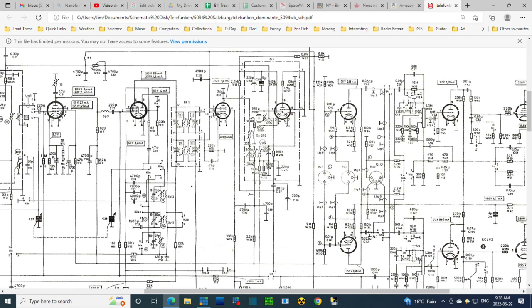One channel appears weak and the other one does not. And I know that because I fed the signal right at the start of today's session right into the connector here, and you could experience the difference. The switch has failed. Is that what it is? Switch has failed.